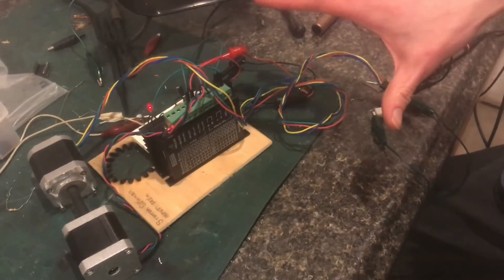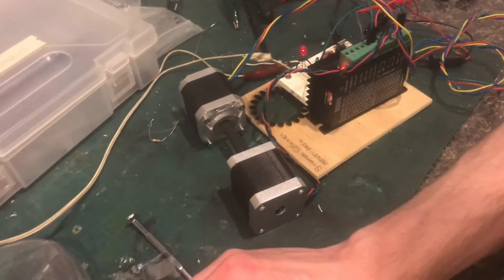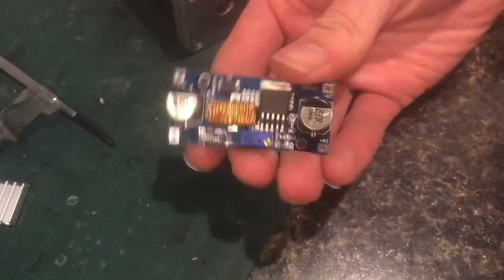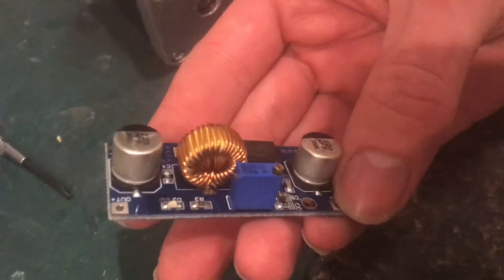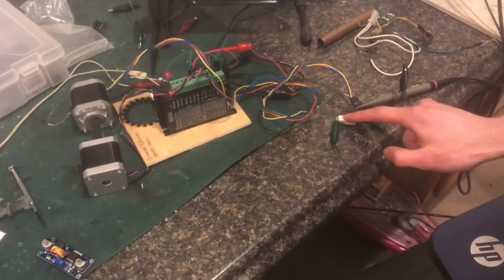Anyway, that's sort of the testing setup, and it was really fun to be able to generate those numbers. I wasn't thinking we were going to get anywhere near 10 watts. So the next step is to convert that AC output from the stepper motor into something more useful to charge a battery. This is an adjustable switching step-down regulator. There's an input side and an output — it works on DC voltage, so what I'll have to do is build a simple bridge rectifier circuit, pretty similar to what's inside of any old wall wart. It will take the AC waveform and rectify it into only DC.